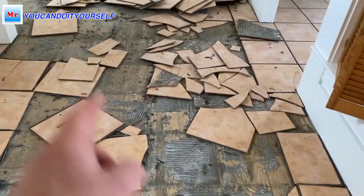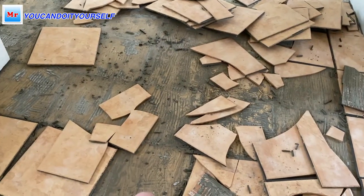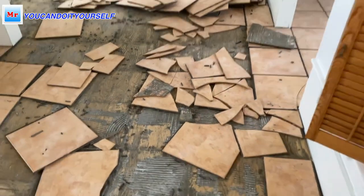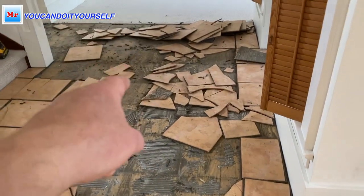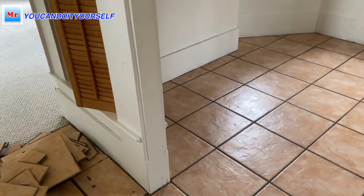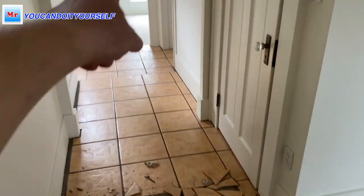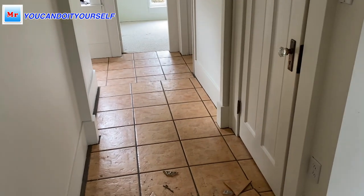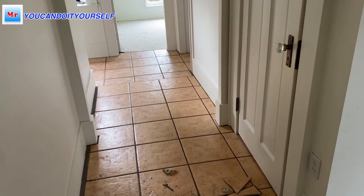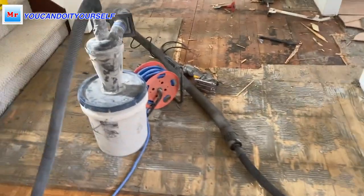About the tile - I'm just removing it and I want to remove the plywood as well. Then maybe we don't need too much leveling, but looking at it the plywood going up here is too high, and this spot is high too. There's a lot of preparation this room needs - we need to put plywood or backer board, almost more than an inch. So let's go.